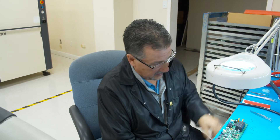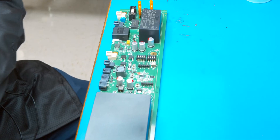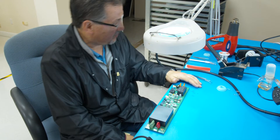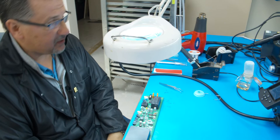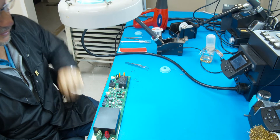Basically I have a board here that has a leadless IC on here that has to be changed. It's a six by eight, four by five millimeter leadless IC. I have some common tools — a pair of tweezers to pull the leadless IC off, and we have our JBC hot air rework station set at 850 degrees Fahrenheit.